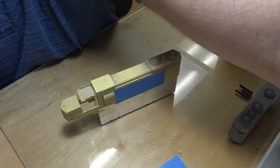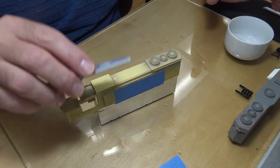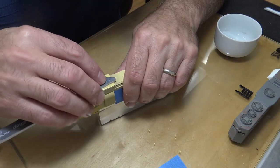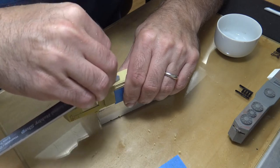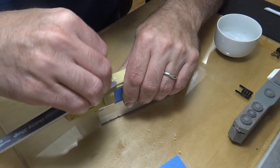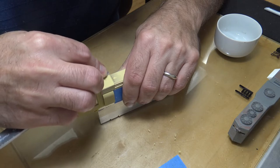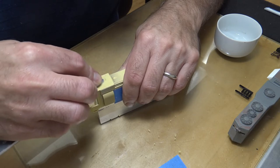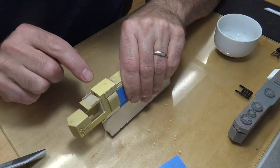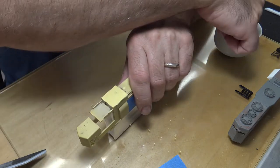Oh, there's a little bit more in there. Let me get this sanding stick out. Now you've got to be careful with these flexible sanding sticks. These will round off your edge, so make sure you keep the pressure on the flat portions. What I'm trying to do, and I don't know if you can see it, is there are some ridges along here from where the milling bit was cutting, and I want to make sure I get all that down onto the same plane.